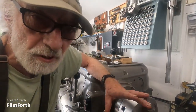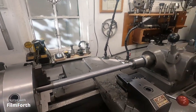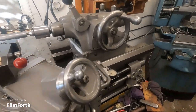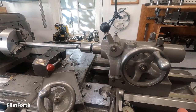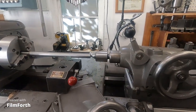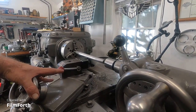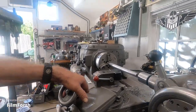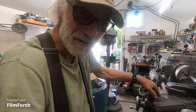Back off the gibs and give that a try. I think you can squeeze that down to a couple thou or maybe nothing - that's the best plan so far, and it usually works. I haven't moved the tailstock at all; the last job it was on, the tailstock had been maintained at a good spot. I broke all the bolts loose so it can be adjusted, but I haven't moved it. Things are looking really good - I'm going to find those sweet spots and the not-so-sweet spots, and keep the carriage on the sweet spots.